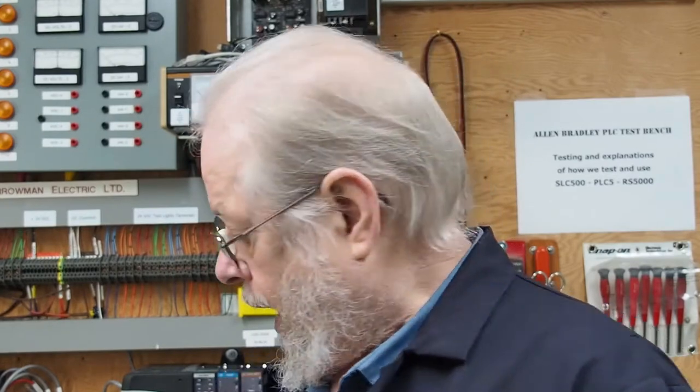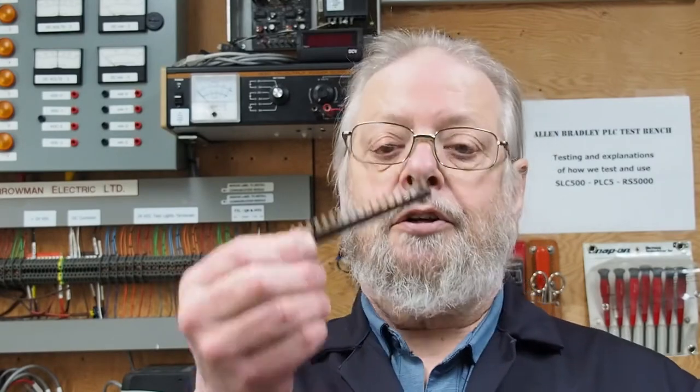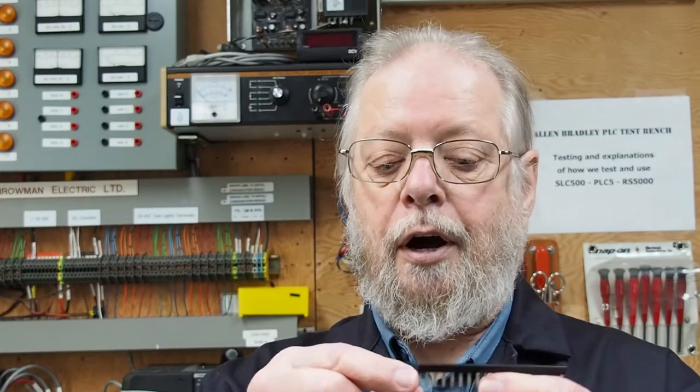Hole number 17 on this side is supposed to be the common that jumpers through the card into all of these. If you're using the Allen Bradley Rockwell actual jumper — I'll do a close-up after — this is what it looks like. It's fully metal, there's no insulation on it, and it's quite thick. One of the ones I've found after a lot of research is a Weidmuller-style jumper. It comes in a length of 20, so you just take your cutters and cut it off at wherever you need it. The part number — I'll put a link in the description — is 1579000000.